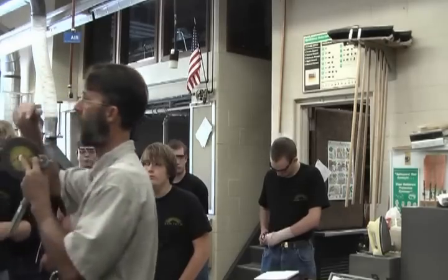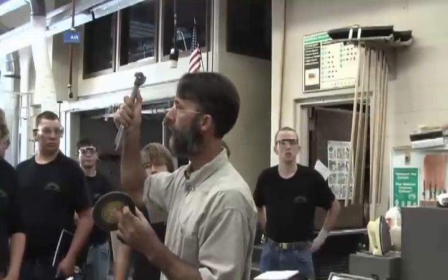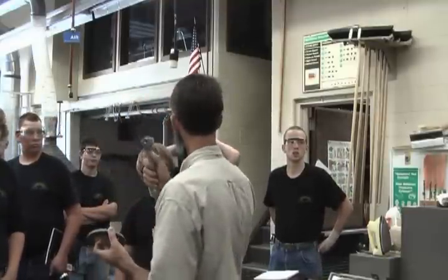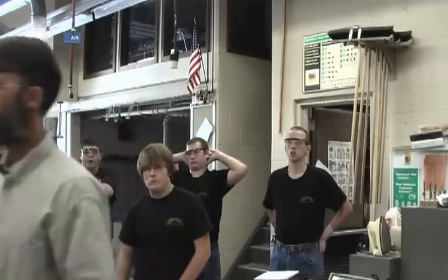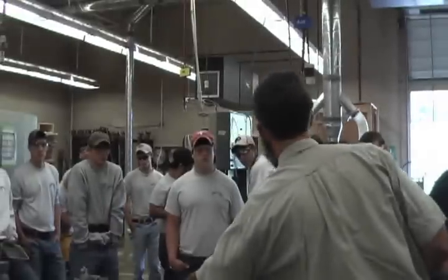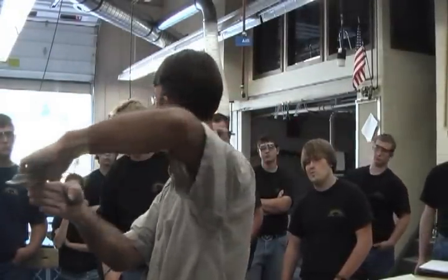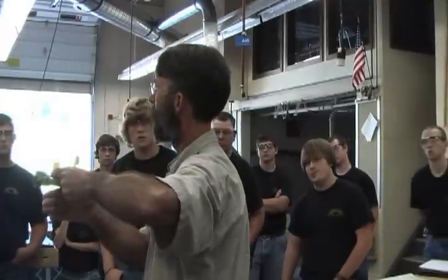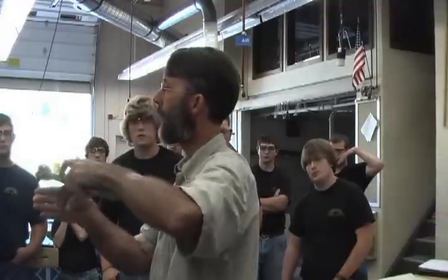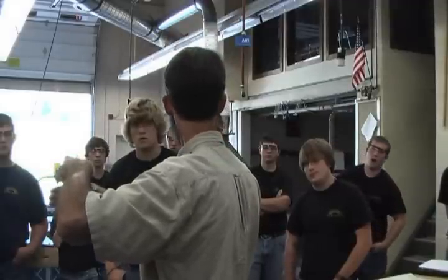Depending upon how accurate you have to make that, they will use something like the diamond stone we talked about. And worst case, they could freehand shape that by moving it around the wheel and checking it with a pattern. They do make special tools. For example, if I needed exactly a half inch radius on a grindstone, they make a special tool that the tool would turn on. Not a complex piece of hardware, probably all metal, and it would do that repeatedly, accurately. Moving the tool in or out would change the radius. Right, so it can be done.